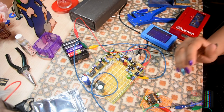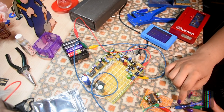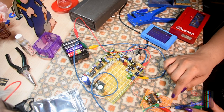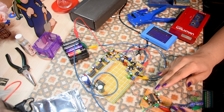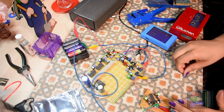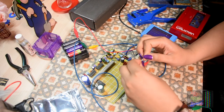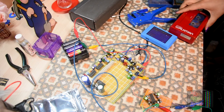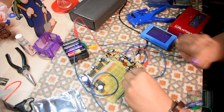Now what I did, my natural instinct when that happens, is to add stabilization resistors to the input. That didn't work. It just lowered the input gain and still distorted. So I was just like, what's going on here? So what I did was I added a stabilizing resistor to the output, and that reduced it. Hold on, let me show you. There you go.